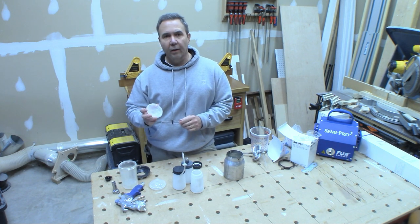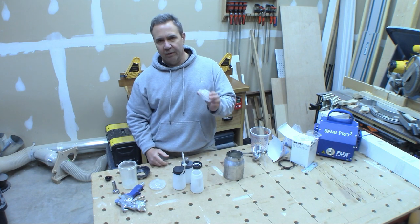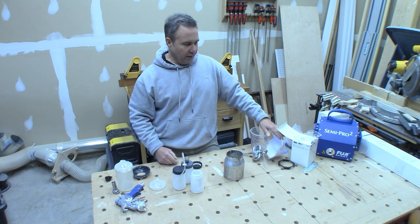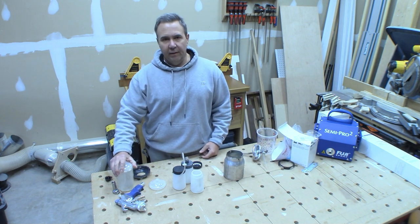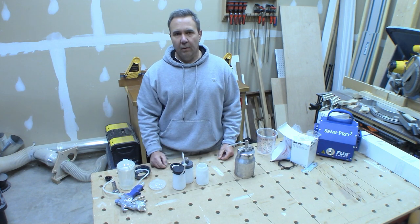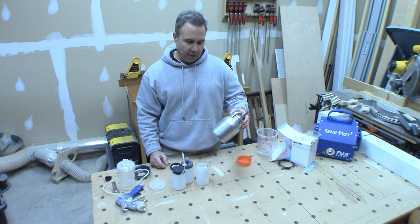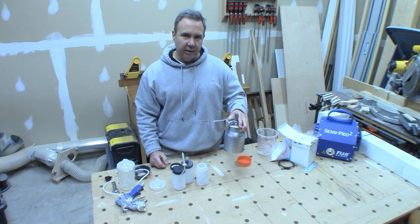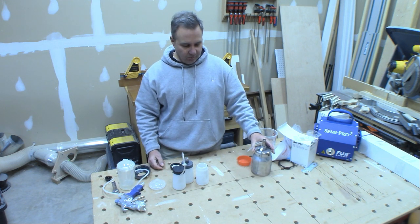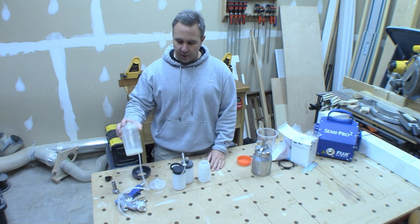It's handy to keep material in a larger intermediate container and keep refilling the mini cups from it since they're only eight ounces. The lids on the 3M system actually have a 200 micron filter built right into the dome of the lid — that's kind of an insurance policy against anything getting into what you're spraying. With the mini cups you can't see inside, so you have to shake them or open them up to gauge how much is left. With the quart and the 3M system you can see right in, so you know when to add more material.